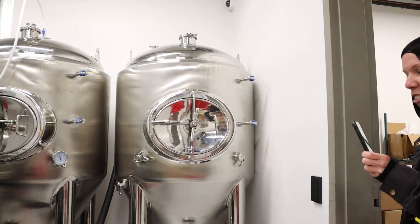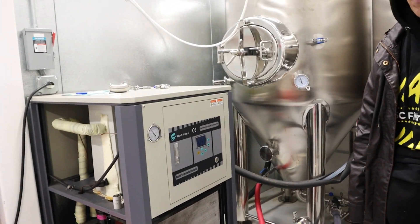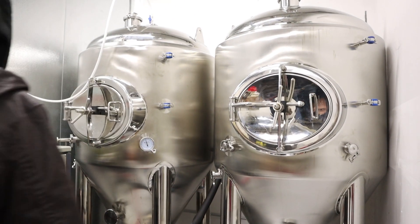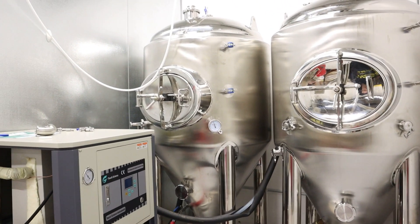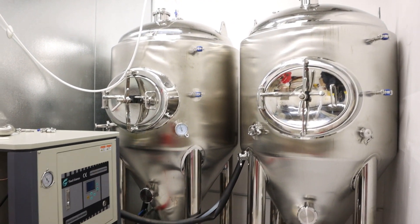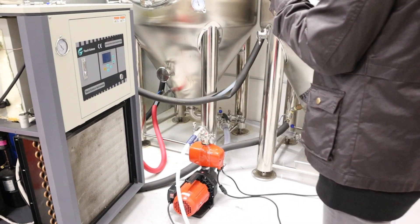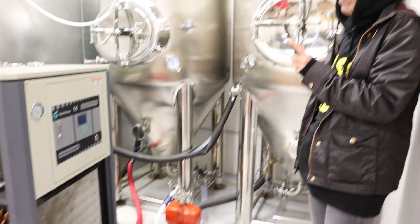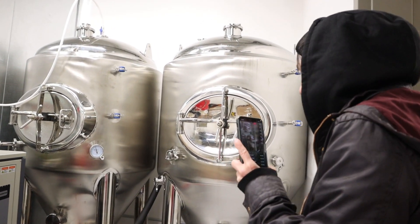So over here to the chilling and the pump: the most efficient way to use chilled water is by having a jacketed tank like this. You would put your water in here and then use chiller water to chill that water. That's more energy efficient than creating ice and using ice to chill. This stores a lot of water. Here they use RO water, which is on a case-by-case basis and personal preference. But the point is, this is the type of setup where you chill your water in a jacketed tank and use it when you wash, instead of using ice. You don't need ice — this is more energy efficient than manufacturing ice.